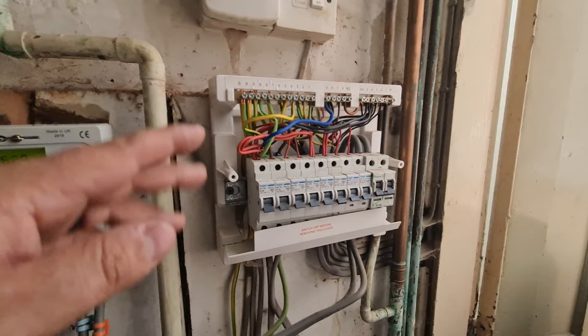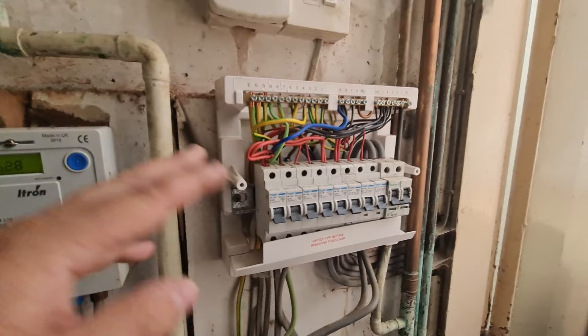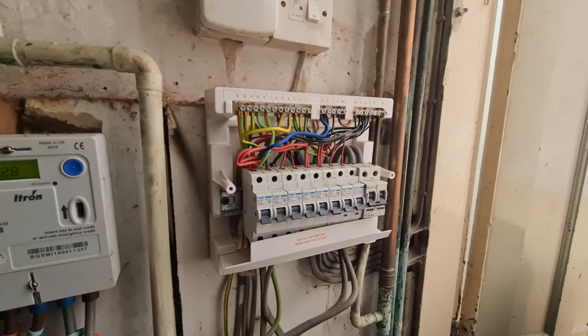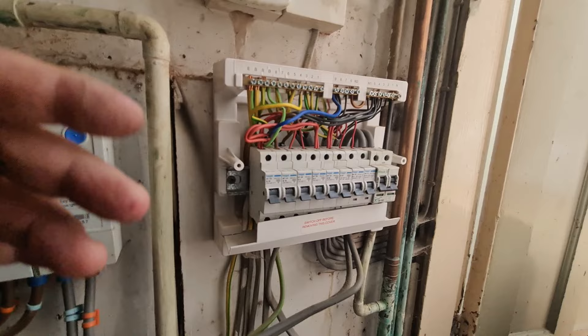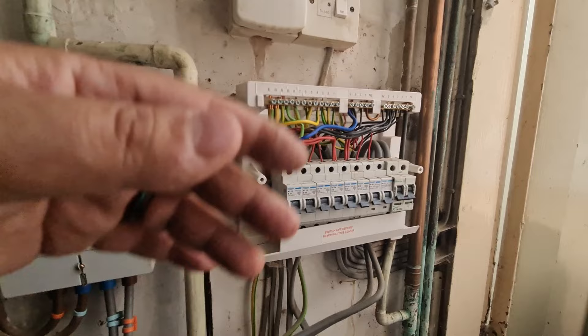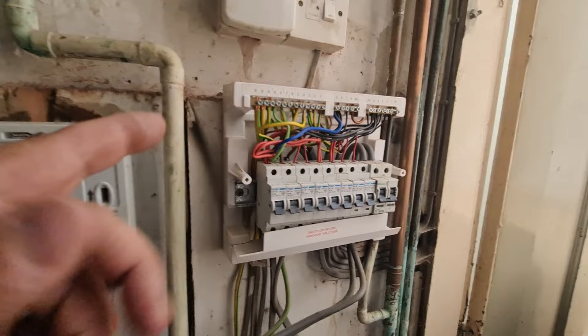Socket circuits are measuring off the scale on IR, which is unusual for an older install. We just have an issue on a couple of lighting circuits: one of them wasn't particularly concerning - still measuring in the hundreds of mega-ohms. The other one was 35 mega-ohms, and like I say, that's due to moisture that's been getting into that circuit. So that's going to need some attention. Even though technically we're above that 1-2 mega-ohm minimum even when taking into account resistance in parallel and series, there is still a problem there. Getting this put back together, then we can go and get some ZS measurements and compare them to some of the dead tests.